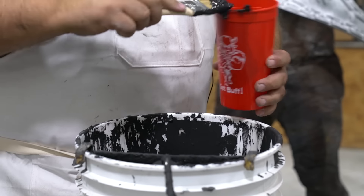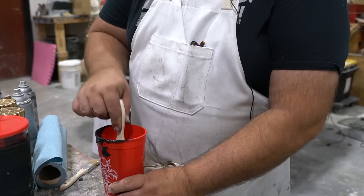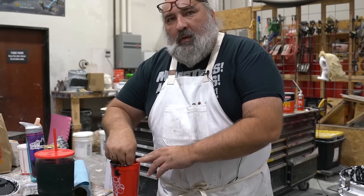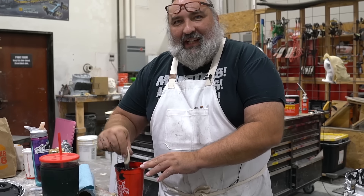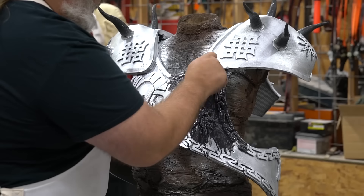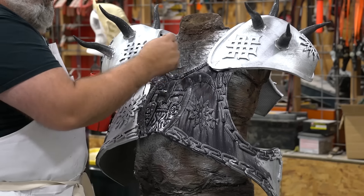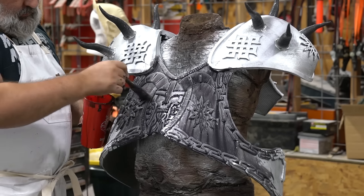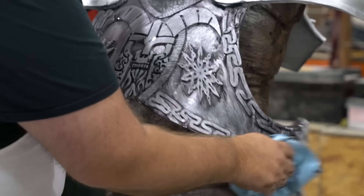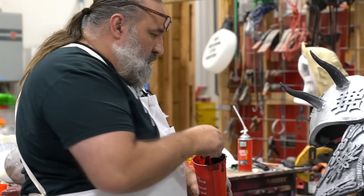This is very old black latex paint and tap water — that's all that's in the cup, mixed together. You want to put it up on the side of the cup to see if it has legs — how much is sticking to the cup, how thick it is, how translucent. I feel that's pretty crusty black paint. What we're doing is an antique process: we have that nice bright silver underneath, and then we're painting this watery black paint. You can see it has a little bit of translucency — that's why we thinned it with water, it was just regular latex house paint. Then we towel it off, we sponge off a good bit of it, and it really highlights the detail in the crevices. All this detail that we lasered and put on is just really brought to the surface by this black wash.